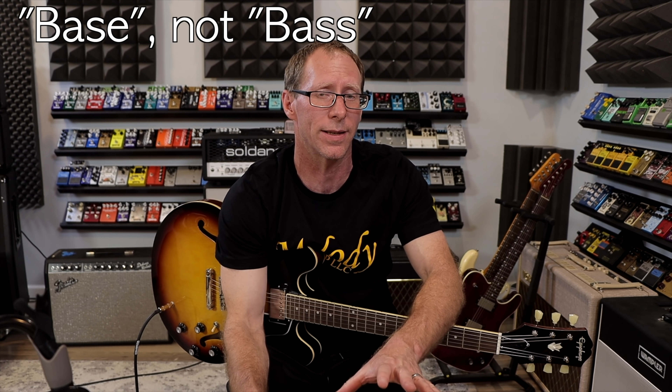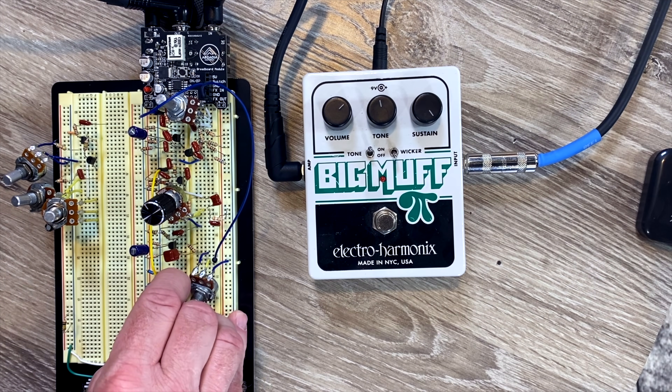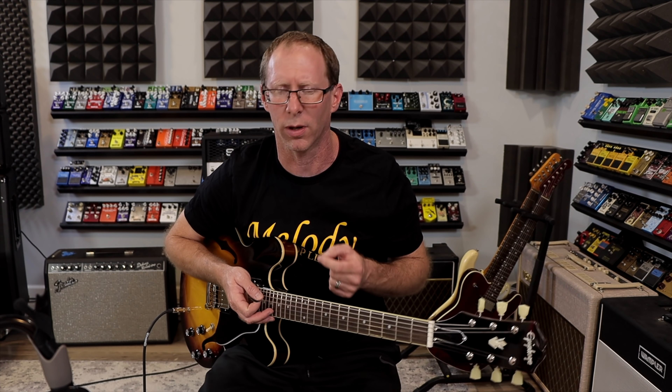One thing I wanted to show: I put some hard clipping diodes right in the middle of the circuit. On the base schematic of this type of circuit, there aren't really diodes to ground — no super hard clipping diodes. It's not super soft like an overdrive, but not super hard like most distortions. The way those diodes are set, it fuzzes up with each gain stage. So let's put those in the circuit, just for fun, to try to get this JFET sound a little more like a Big Muff.